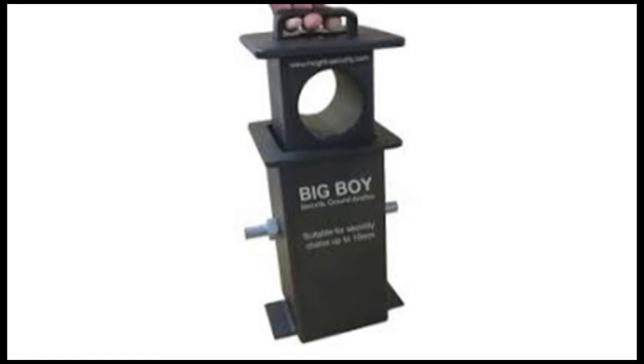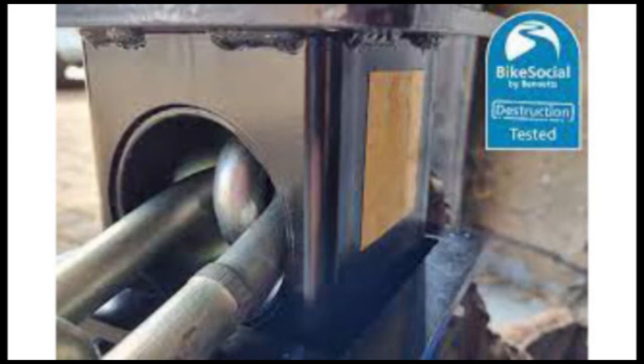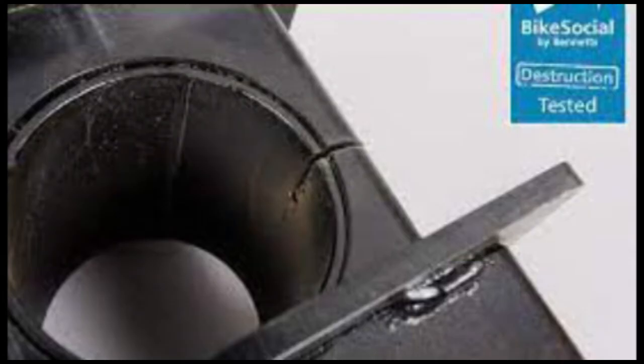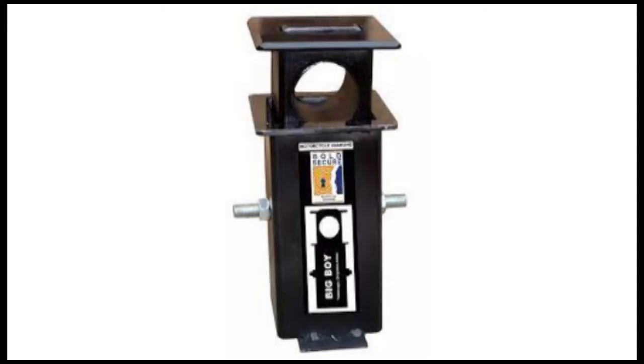The entire anchor has an electrophoretic coating that promises full coverage of the paint finish, while the top, which is exposed to the elements, tires etc., is powder-coated. The top plate, which measures 150 mm by 150 mm, is 8 mm steel; with the powder-coating it's 8.2 mm thick. The section it's attached to is 3.6 mm thick.